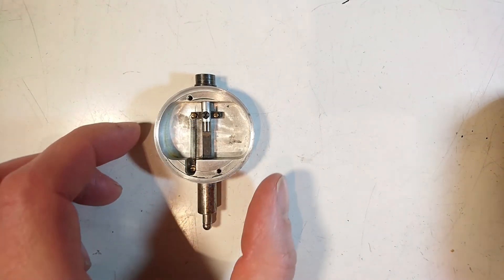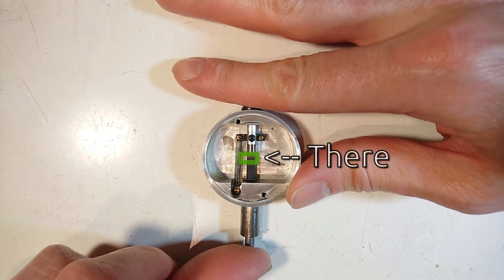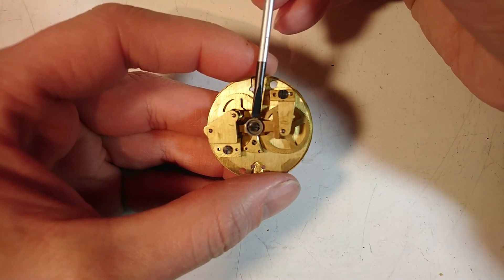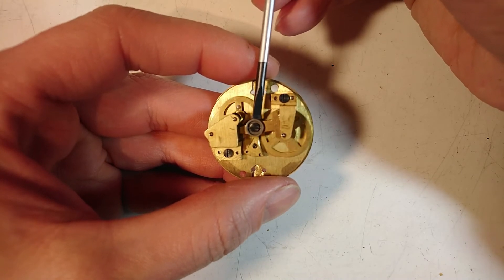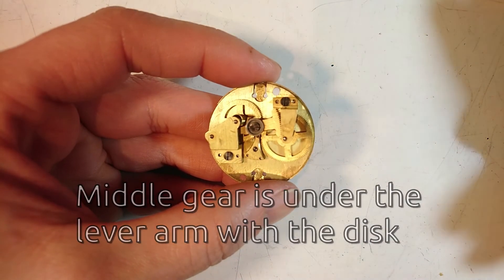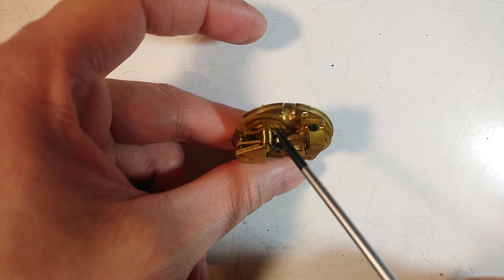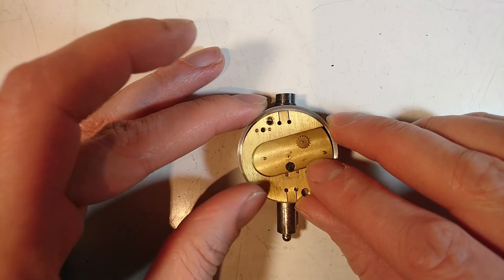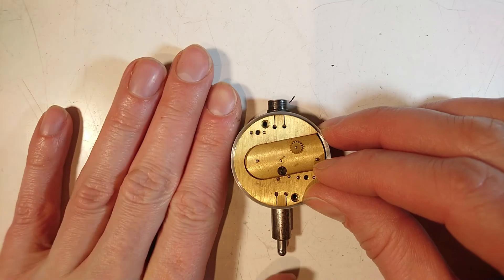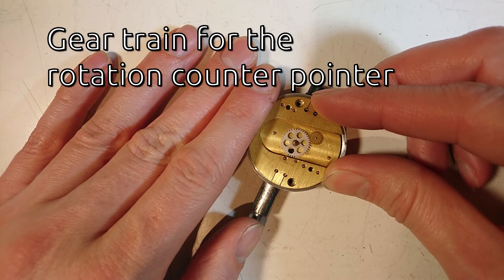Here is Joe from editing the video. I guess I should explain how my indicators work. The push rod interacts with the gear train via this edge — it pushes against a round disc that moves a gear segment up and down. That segment turns the right large gear via a small one. The gear is connected via another small gear in the middle to the left large gear, and the middle gear turns the large pointer. The left large gear is spring loaded to take up the backlash of the mechanism. The spring gets tensioned when the indicator is in resting state, and when the rod is pushed in it is that spring that turns the wheels. I actually had to clean all gears of that indicator before it was reliable again.